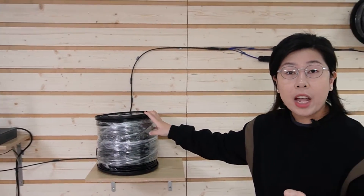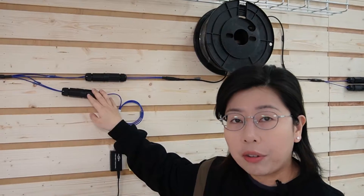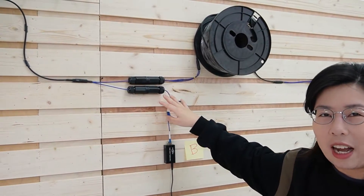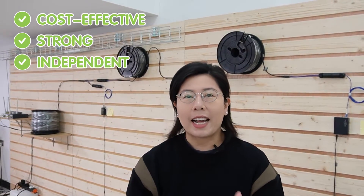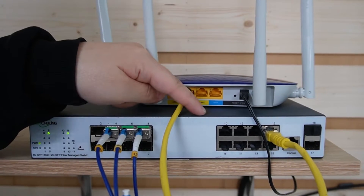Just like this. We're going to use a fiber optic LC coupler to link one of the strands to the next location — to point B. Then follow that with another LC coupler to connect one of the strands to the next location and to a media converter, so you can connect to multiple devices like cameras. Now this setup isn't just smart — it's cost effective, with every link to the switch standing strong and independent. Let me explain the setup in detail: we have the router to provide the main network data, connected to our main switch.